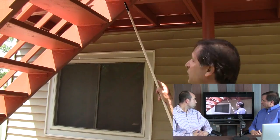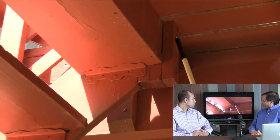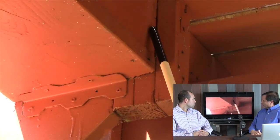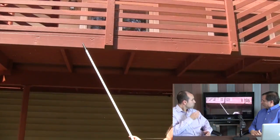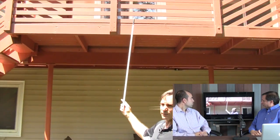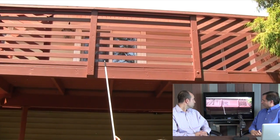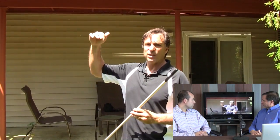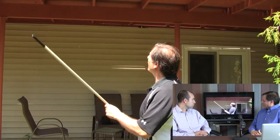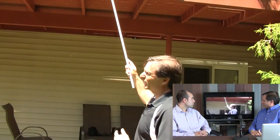The reason is there is a shear-off strength with a joist hanger nail — a number 10 — which is going to have a certain amount of strength associated with it. Simpson has a nice product that would nail on here with joist hanger nails and come around and hold the bottom of this stair. At the time this deck was built, the code was probably eight or nine inches between railings. But there is only about three inches in between — and all railings now have to be vertical so there is no area to put a child's foot to climb up. The height looks right — it needs to be 36 inches.